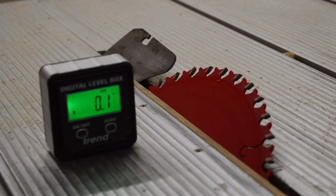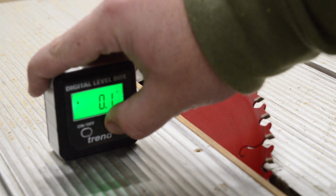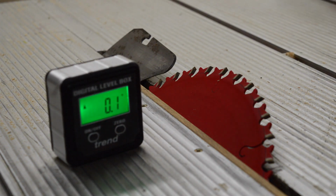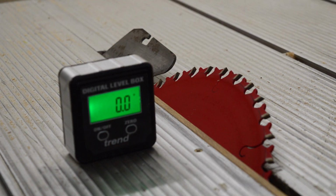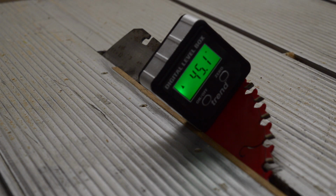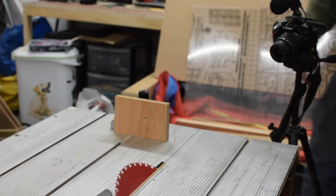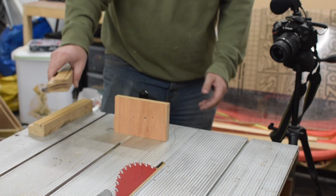For my 20+ year old electric Beckman table saw, I managed to find a compound mitre extension that fits into the slot that is on the table. One of the things I identified as an issue when trying to set the angle of the table: the motor weighs an absolute ton when trying to tilt it, and secondly, because the tabletop is grooved, setting a digital level finder is quite problematic.